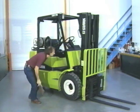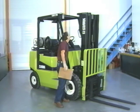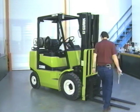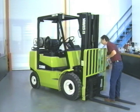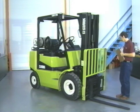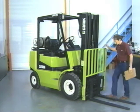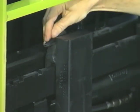You should first do a visual check. Look for leaks under and around the truck. Check the upright for worn, misadjusted or broken chains, damaged rails, or leaky hoses or cylinders. This is a visual check only — never put your hands, arms, or any tool or other device in the upright. Make sure the load backrest extension is secure, its welds are okay, and that the fork retention is in place.